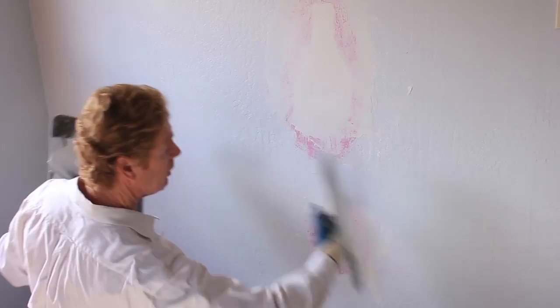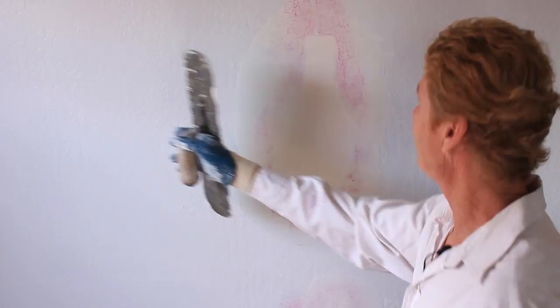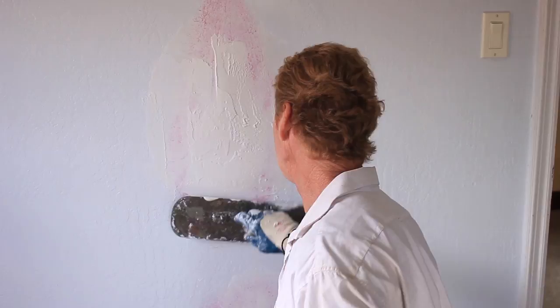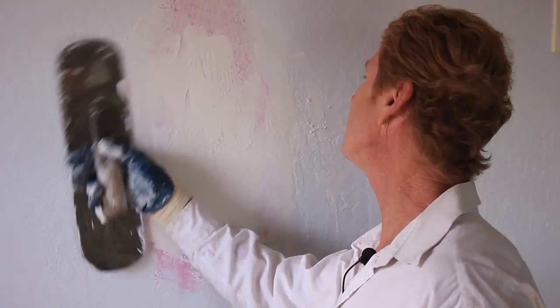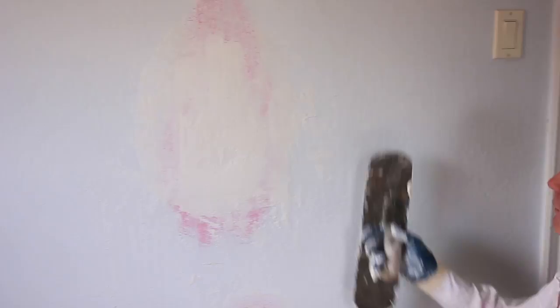What I'm going to do is just take a little tiny bit off here and look at what they've got. Let me get out of the way and just pull it sideways — if I don't pull mine sideways, it's not going to match theirs. That's all we do: move it sideways, pull it. And if you miss a little spot, you can always come back to it. Then how flat theirs is, I flatten mine out. Nothing to it. And if the mud is a little too soupy, I'll give it five more minutes — I'm in no hurry. For the sake of showing you guys, that's it right there. We just give it a little skip trowel finish and we match it.